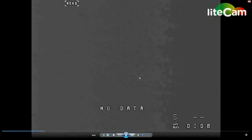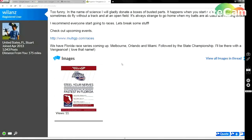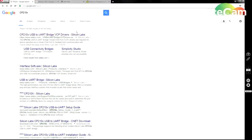You can't see the firmware version. No data. It's just not talking to the flight controller because the flight controller is burned out. So, looks promising. As of right now, I don't really know what to expect, but I strongly assume that it will work. And so I'm going to go ahead and walk through flashing the latest MWOSD firmware to the Vengeance